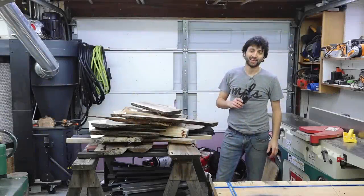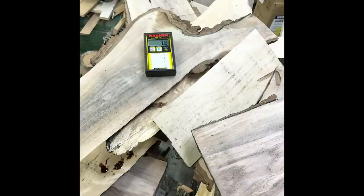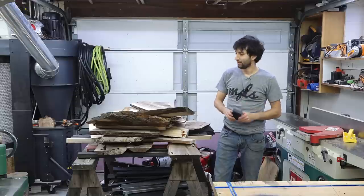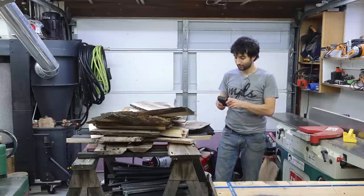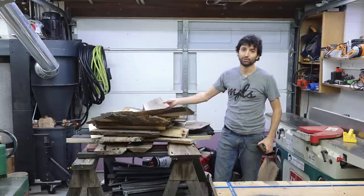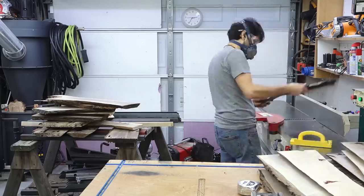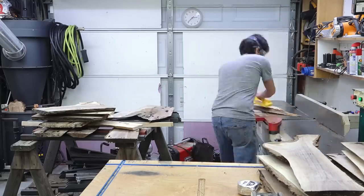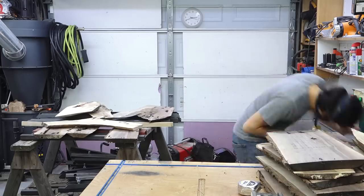These have been sitting stacked in the shop for a few weeks. When I brought them in they were reading about 16%, and now they're reading about 7.5 to 8%, so they're ready to go. Last night I came through and did some epoxy fills in some places just to clean things up a little. Add another 20 minutes to the board and we'll get back to the same exact process all over again.